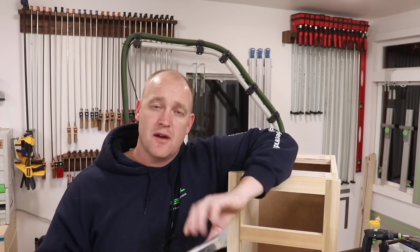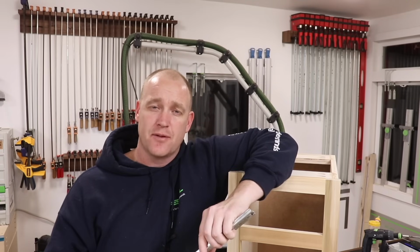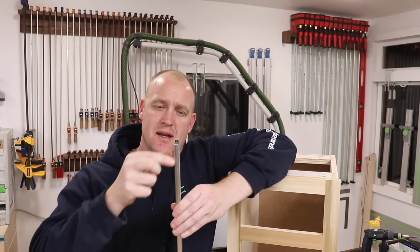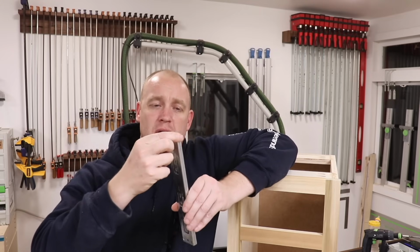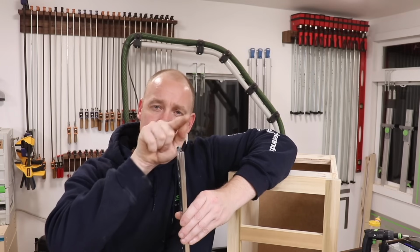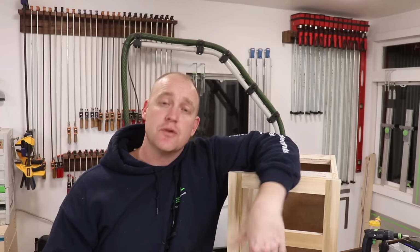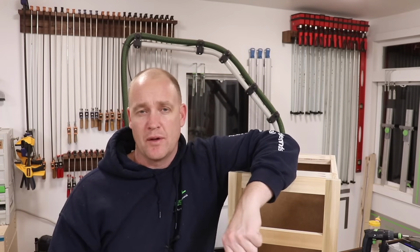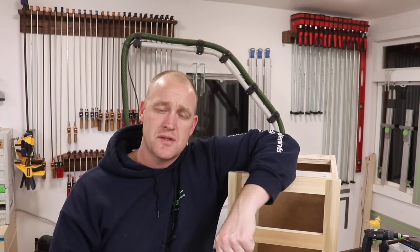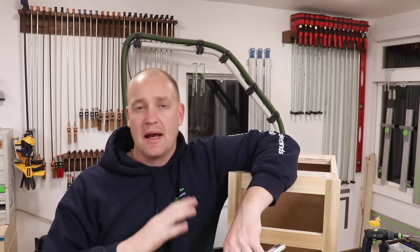When it comes to the spacers for the drawer slides to ensure that the slide itself sits flush to the face frame, that's not necessarily your only option. They actually do make what's called L brackets that will click onto the back of your drawer slide, and it comes up and makes an L shape, and that L shape has a bunch of holes that can be screwed into the back wall. The type of material that you're using for the back wall obviously will make a difference on whether or not you can use those. The simple solution, if you're going to use face frames and still install drawers and you have that gap, fill that gap with something, attach the drawer slide to it, and you'll be good to go.